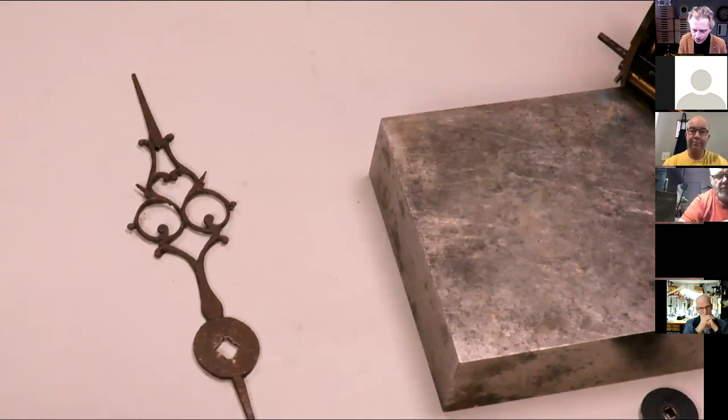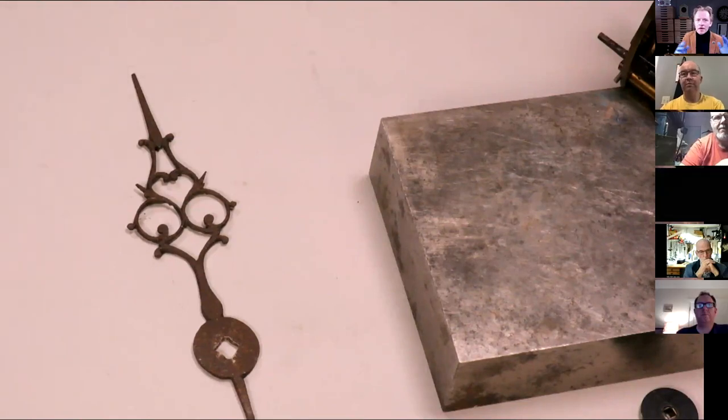I mean, on 18th and 19th century clocks, again, you get a lot of things to do with dial feet, where the clock's either been dropped or something's been changed, and the front plate of the movement and the dial are no longer parallel. So as the hand rotates, it's closer to the dial in one place than the other. On our old live stream clock, we had something that had been broken off and so on. So really important to stand back.